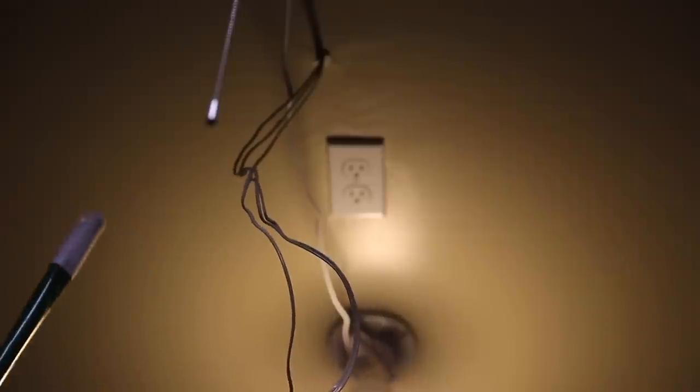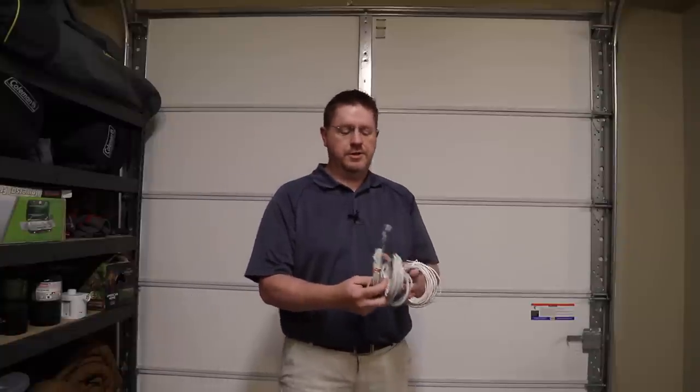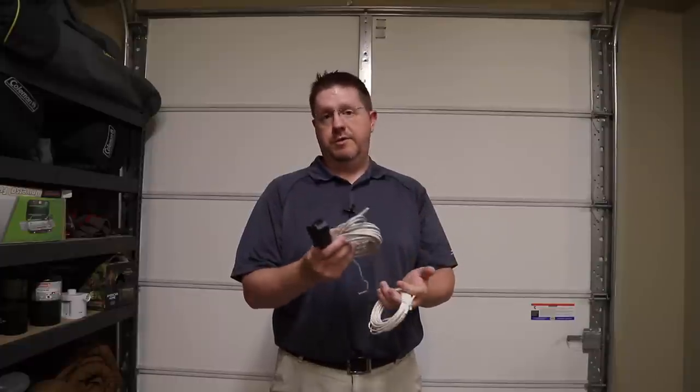You'll need to also make sure that you've got wires like these already installed before you can put up the opener. These were installed here by the builder — one of them is going to be for the opener on the wall, and then the other two are going to be for the sensors at the bottom of the door. If you don't already have those installed, you'll need to get those installed yourself. You don't have to put them through the drywall; you can use a staple gun to attach them to the surface. This kit comes with wiring, but we're mostly not going to be using it — these are the two sensors that go at the bottom of the door.